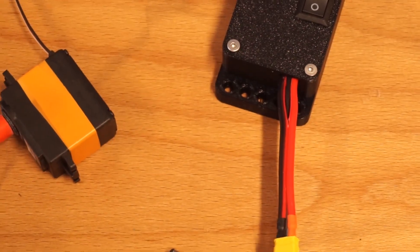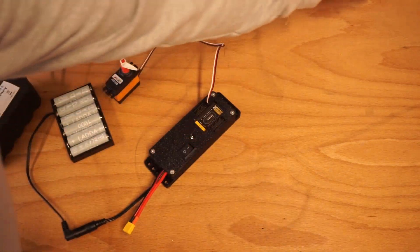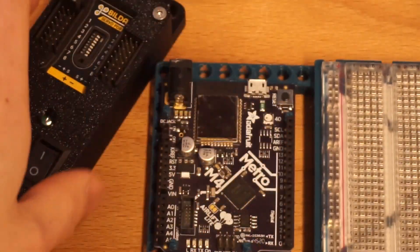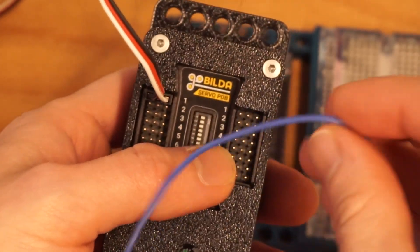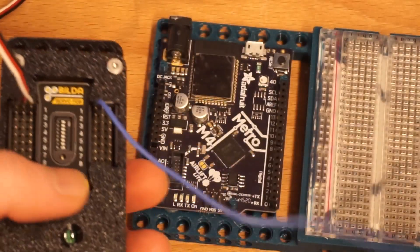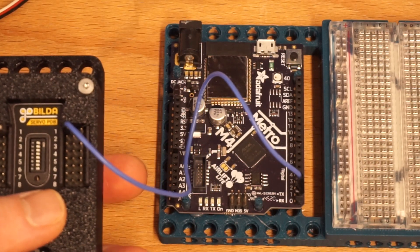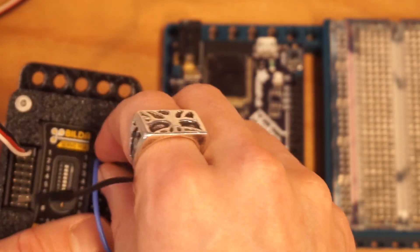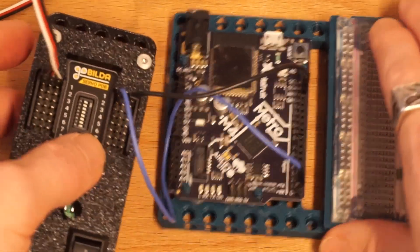Once I've got this side in, I'll plug in my battery pack. Then I'm going to wire this to my microcontroller — make sure you power your microcontroller down first. Wiring is super easy: grab the signal wire from number one and wire it over to whichever pin you have your servo outputting to — I have mine set to D0. Then get a ground wire from the ground pin over to your shared ground. It doesn't matter which ground you choose on your board, as long as you're getting back to ground.